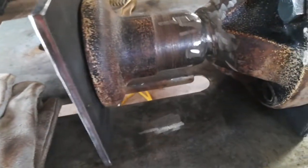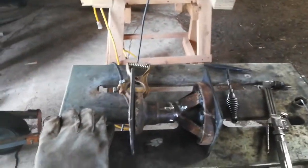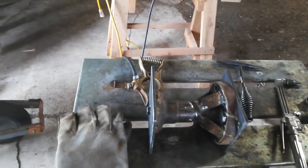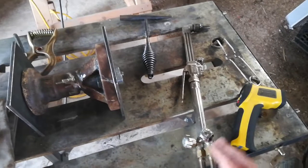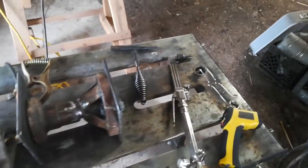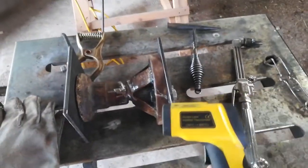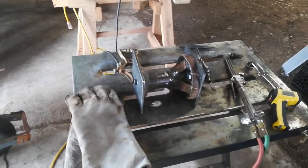I ground all the way around so it's just barely holding. I think it's gonna burn through eventually when I weld it, but the plan is to preheat this with the torch at least two inches on either side, so I'm gonna put a lot of heat into it. I think I want to be up to 700 degrees or so — 1400 is too hot, that's what they said the maximum is.